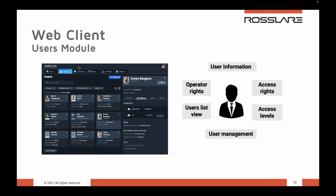It's better you create the access level or group level according to the level, the floor, or if it's an office, according to the department, accounting, human resources. It's better. I know, and we understand, sometimes this takes a little more time when you need to create all of these features and you want to enroll all cards very fast, but taking these few additional minutes helps a lot to your final client and to you when you have some issue or need to repair or replace a card. So you can do everything in this tab.